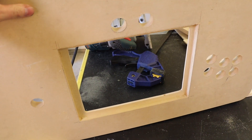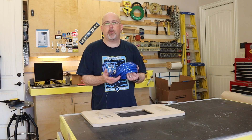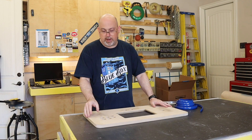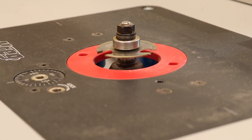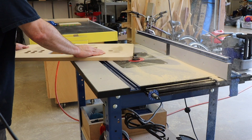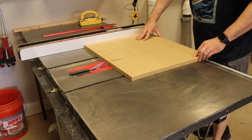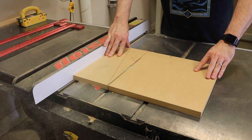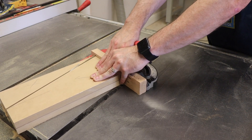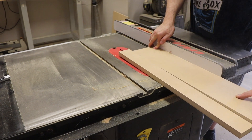You can see how the LCD panel will fit nicely into this recess. I love T-molding in my arcades — it just gives them that retro feel. I'm going to put T-molding around the tabletop, so we'll have to route a channel with the router around the edges over on the router table. Next up it's time to cut out the base of the tabletop arcade over on the table saw. I recommend you cut both side panels together to make sure they are perfectly matched. I'm using the miter gauge set to 15 degrees. For the front and back sections of the arcade, I tilted my blade by 15 degrees. If using a jigsaw or handheld circular saw, just set them to 15 degrees as well.